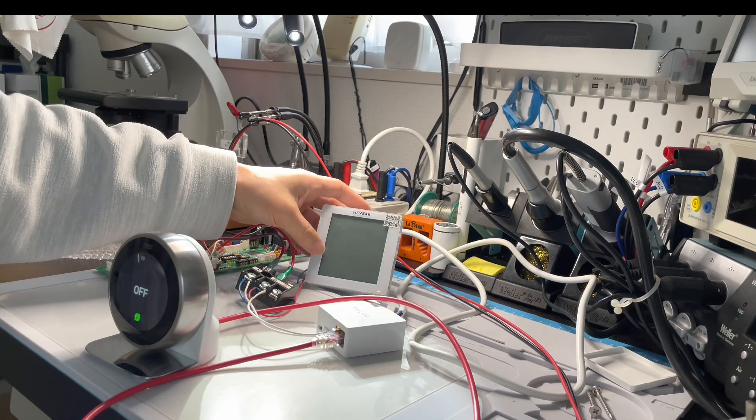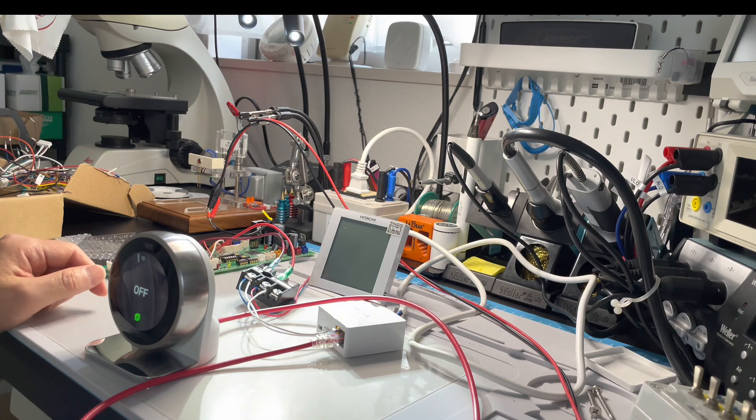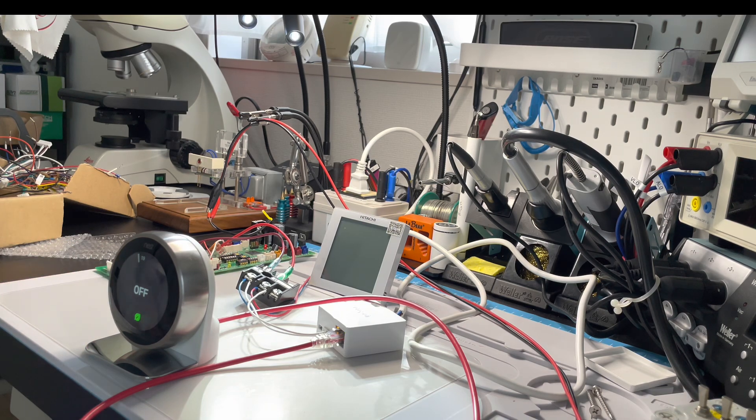If we install the adapter beside the indoor unit, it is easier to connect the two-wire signal on this terminal. Power off the indoor unit first, then connect the wires. For Hitachi, you can see these two wires do not have polarity, so you can connect either of them. Then power the indoor unit back on.